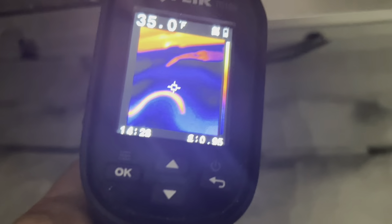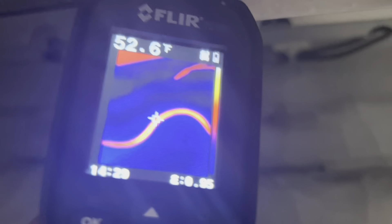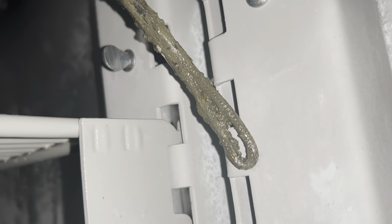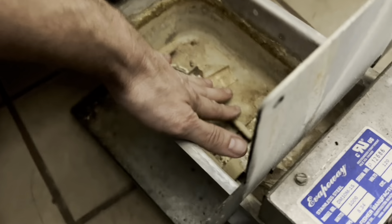The ice around it is 19–16 degrees — none of that's above freezing. Well, 34–36 — that's catching my loop, that's the physical heater. This is my drain line. I'm going to chase the wiring, find where it connects, and make sure we're getting voltage to it. I just pulled it out of its tube and you can see it is gummed up. I think it may be heating but the tube is just clogged. Behind this unit there's a drain pan and as you can see she has not drained in quite some time — there's a p-trap and s-trap on here.